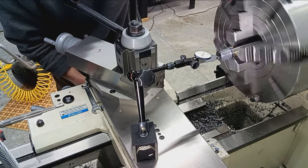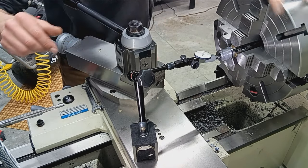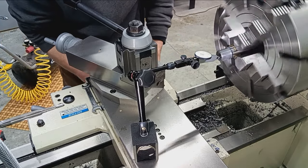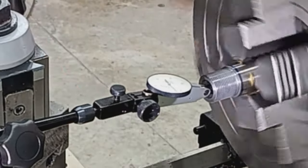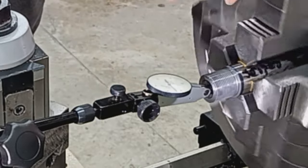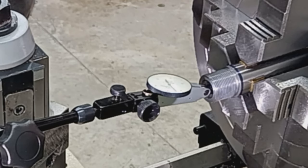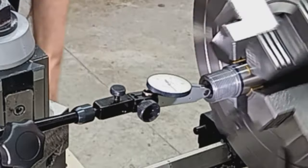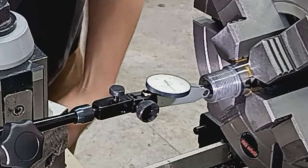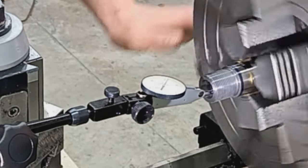Then we're going to come down here. Okay, there's the pre-bore section, just ahead of where we're cutting. And again, I had the boring bar, so I took that pass, and I didn't actually push forward before I pulled out. So the boring bar just did a very light cleanup on its way out. So that's all you're seeing there, that little jump. That was my fault. I was not thinking when I did that. But anyway, there's the pre-bore section, and then we'll come back to where the reamer's cutting.